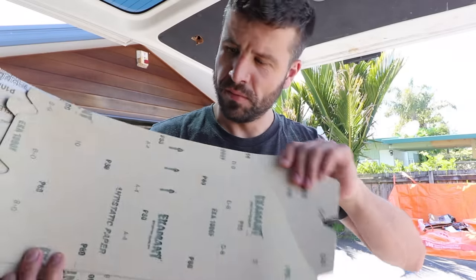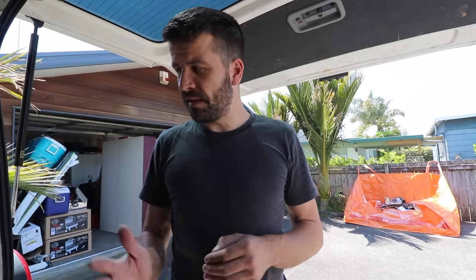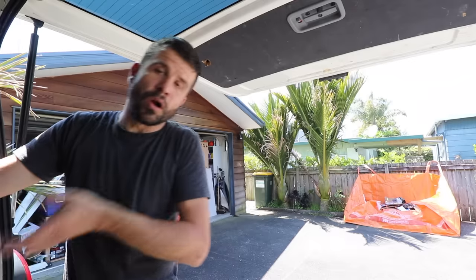The whole reason I got the sander this morning and all these sanding discs is because we need to take the layer of varnish that's on the floor off, so when we put our new flooring over the top it can stick to it — we're going to glue the new flooring. Also with the sander, I'm hopefully going to take out this big hump that's in the floor. So once we've punched all the nail holes and got this hump out of it, we take all the varnish off, and then Pardo and I can start putting the floor down.